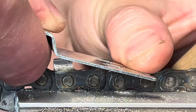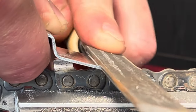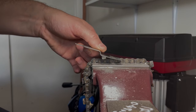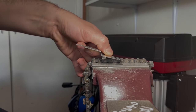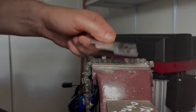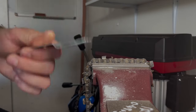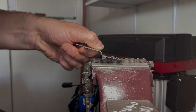There's probably about half a millimetre on the top — it will probably be one or two passes max. Now, why didn't I just leave the gauge there and run over it? Because there's a chance you can overshoot it. I'm very close to overshooting it — didn't expect it to come down that quick. The reason is because each time you use the gauge, you'll occasionally press on that working corner and end up dulling it slightly. Yes, you can go lighter with fewer passes, but sometimes it's just easier to take the gauge out of the way, do a few passes, double check it, get very close, and then the last few passes leave it there and you'll be fine.